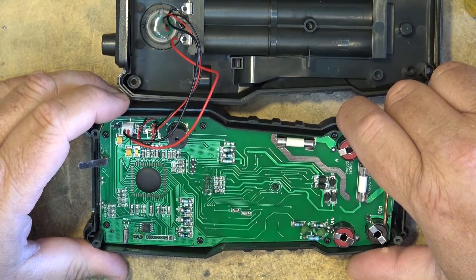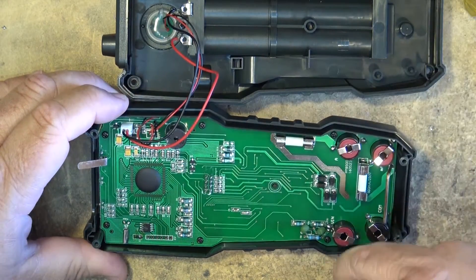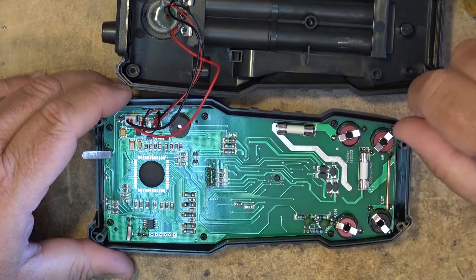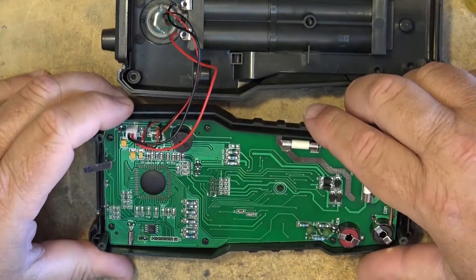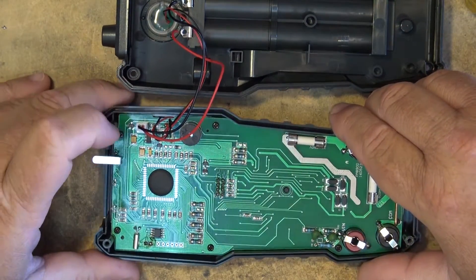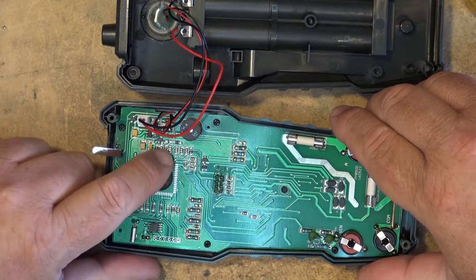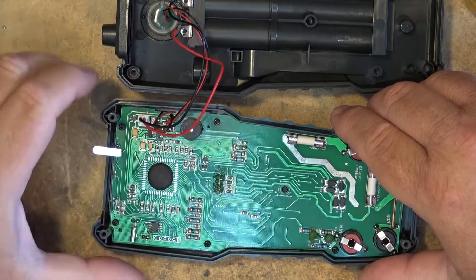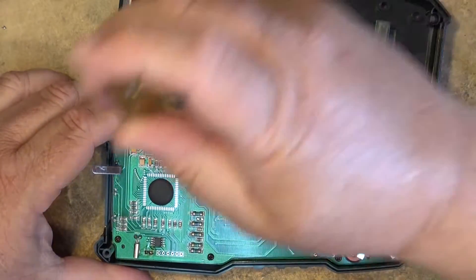The milliamp test goes through a 650-milliamp fuse. We've got a couple of MOVs here and PTC components — the MOVs protect against over-voltage. Everything is pretty much all on this one big IC; it's an encapsulated custom ASIC that they've made for this unit.